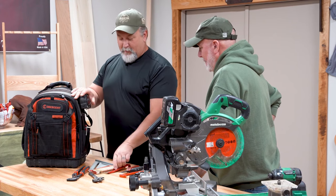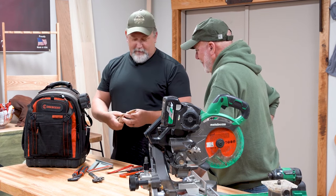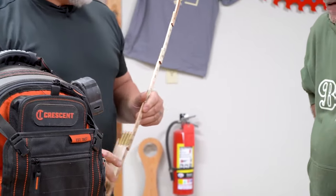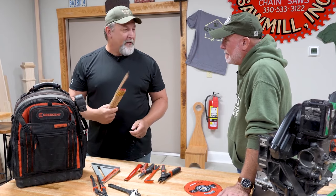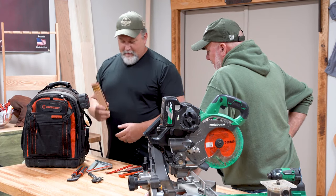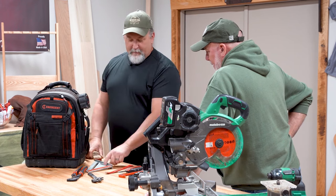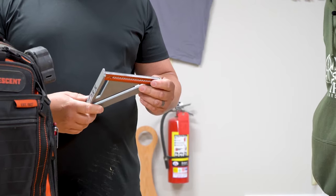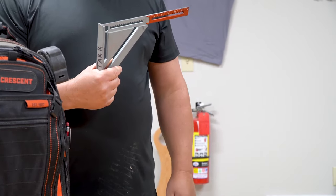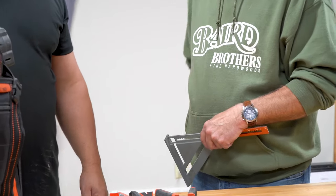That tape measure has become a critical tool. And probably if any of you had a father with carpentry skills, you've broken multiple folding foot rules in your childhood — it's the old trusty foot rule. This adjustable Crescent speed square is invaluable; it never leaves the right hand pouch. The convenience of it is that you can use it not just as a marking tool but as a straight edge for cutting a piece of 1x12, then collapse it back into your pouch — out of sight, out of mind, but at hand.